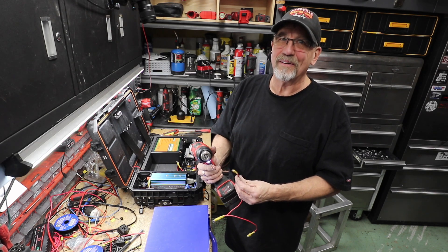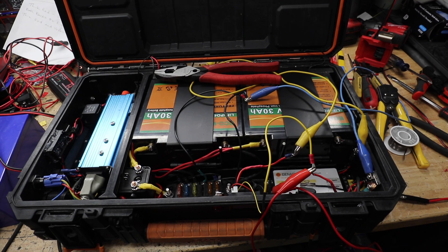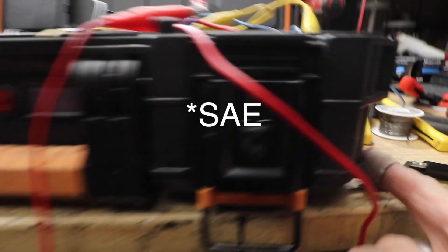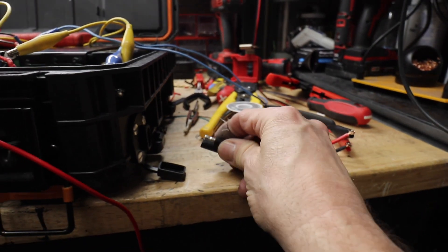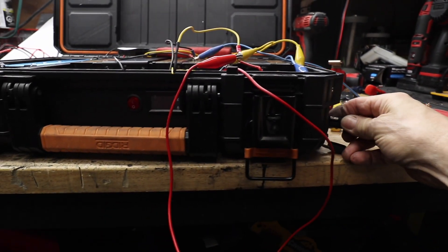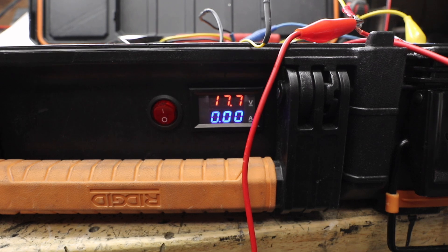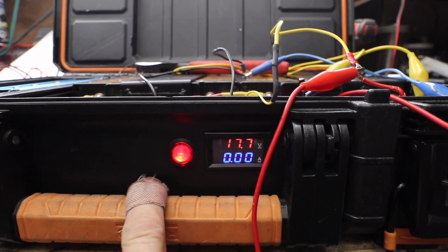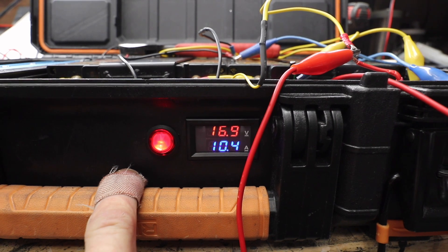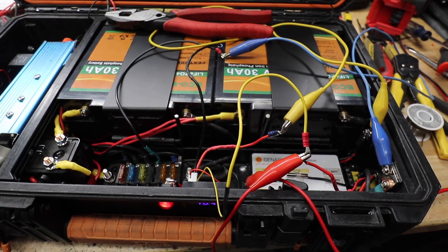Can I say we're coming down to the wire now? Update time. I'm working on this little gauge in the front — it only comes on when a solar panel is plugged into the SAE port on the side. Since it's dark out, I'm using my power supply hooked onto the SAE connector to simulate a solar panel. When the solar panel gets plugged in, the gauge comes on and starts reading the voltage from the panel. It's reading zero amps right now because the circuit is open between the charge controller and the battery. As soon as I flip the switch, it closes the circuit and shows the amperage going from the charge controller to the battery. Everything's working the way it's supposed to.